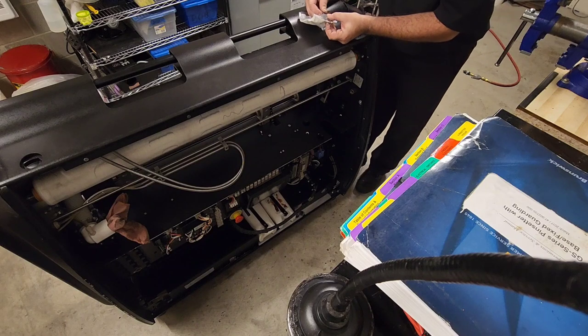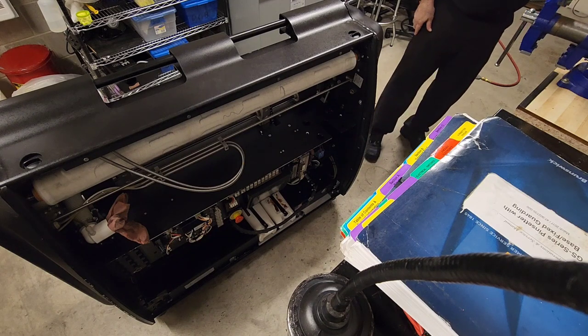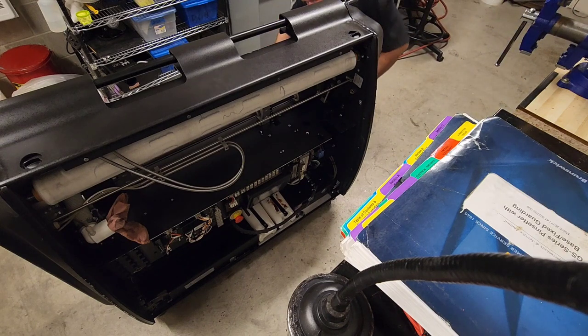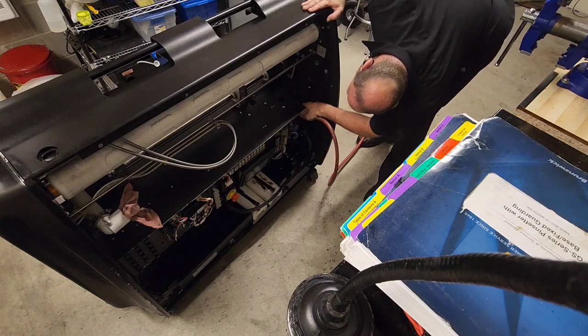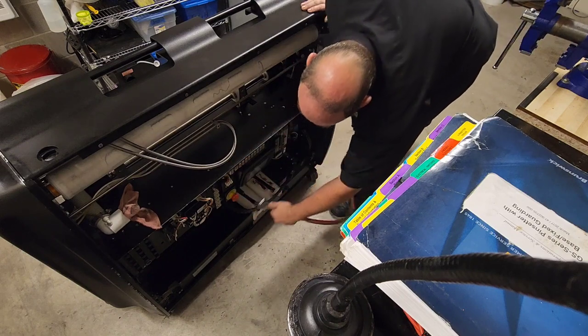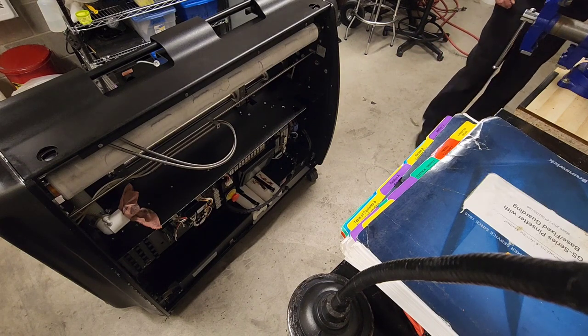So let's look at our brushes. Here, they're about 3/16 of an inch down. These were done a couple years ago, but we're here. Drive motor brushes aren't very expensive. It's good insurance. Let's blow this thing out. Oh! Big old cloud of dust came out. Hit it from the other side too. Why not? Yum. Blow everything off while we're here. Cool. Extracurricular activities.